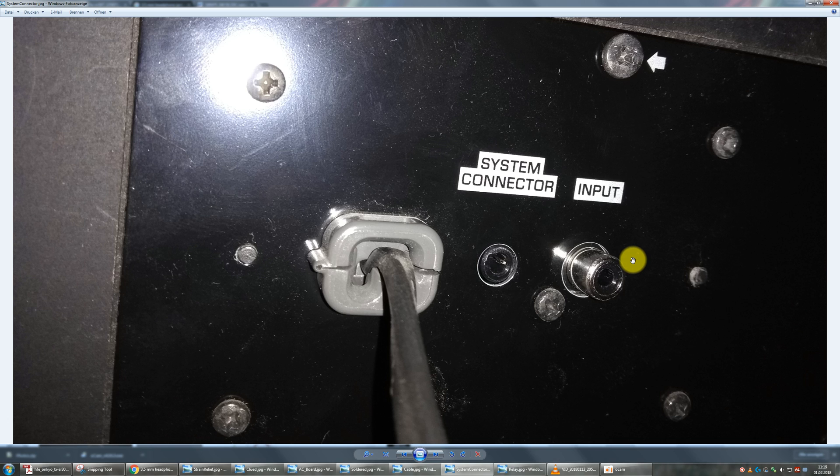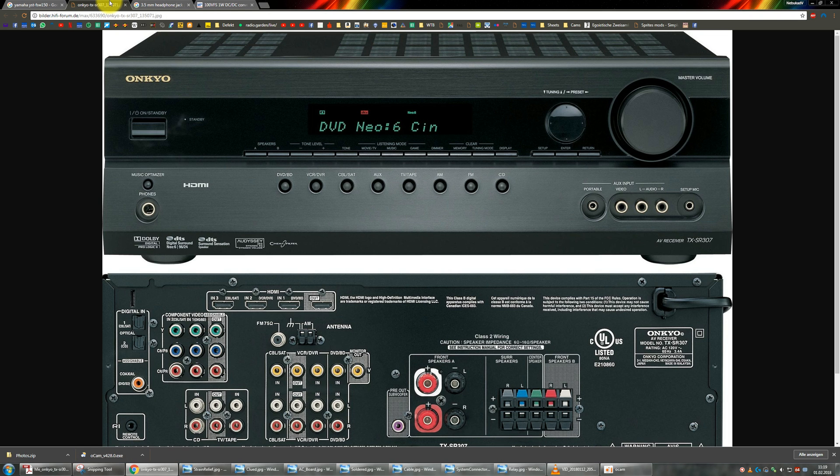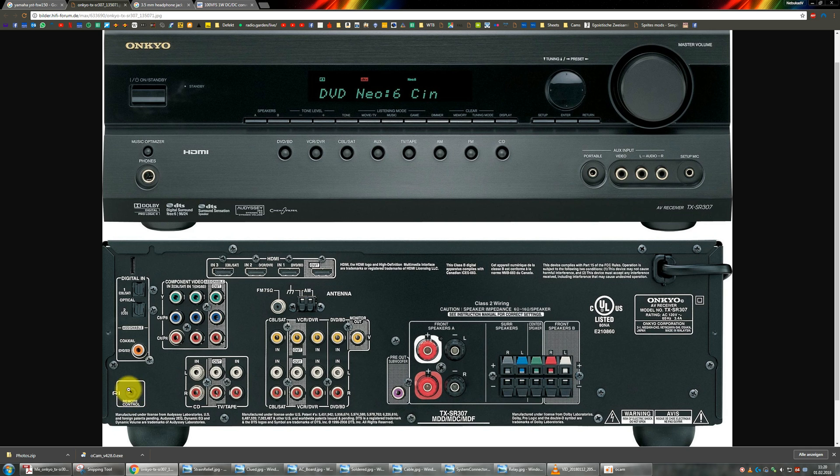So this is why I ended up using a DC-to-DC converter, but you can also just put straight 12 volts in. The question is, how can we make this subwoofer turn on when we just turn on our amplifier? The amplifier present here is the Onkyo TX-SR307. If you look at the back, there is also a 3.5mm headphone jack called remote control, but this is an Onkyo-specific thing — it's actually a digital control line, more or less a communication bus, so you can plug it into the subwoofer but it won't do anything. It's just to let different Onkyo devices share one remote control, so unfortunately you cannot just use this one.